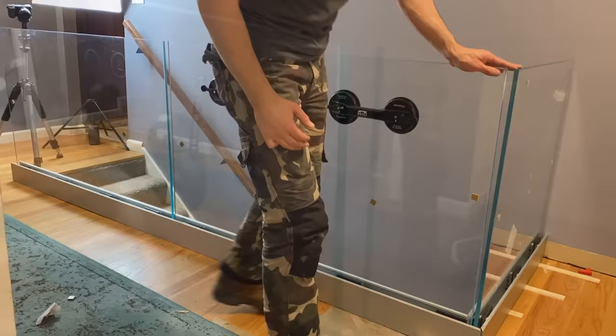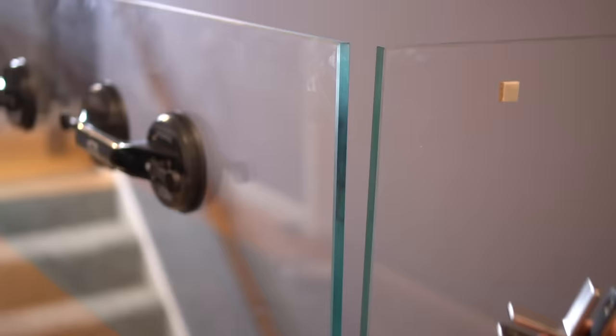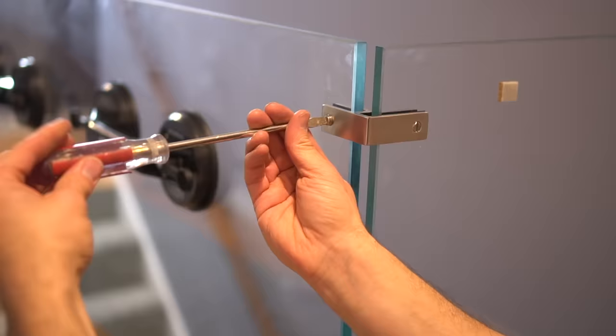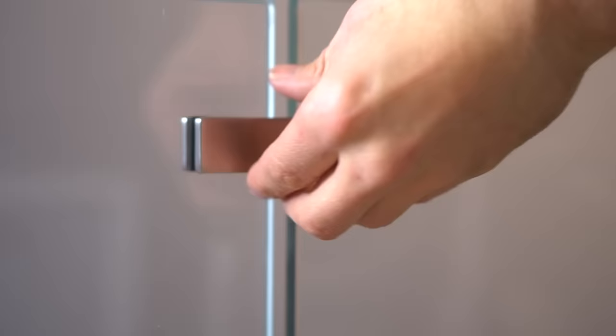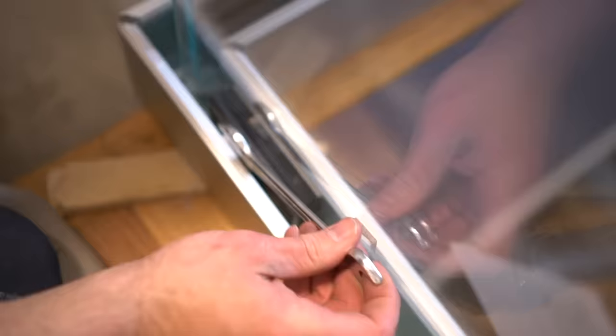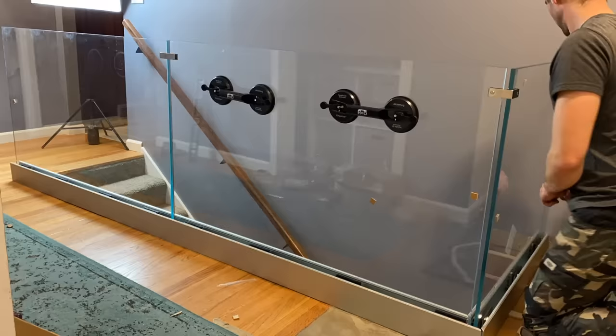As for hardware, we have a panel-to-wall bracket, a panel-to-panel straight bracket, as well as a panel-to-panel corner bracket. I decide to install my panel-to-panel corner bracket first because I want to make sure these panels are perfectly aligned exactly where I want them before I start tightening the glass clamps. The glass clamps do allow for correction and adjustment, but getting the panels aligned first with these brackets makes the tightening process a lot easier. At this point I can take my skinny open-ended wrench and start tightening the bolts — just a nice, quick, easy turn a couple of times.